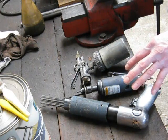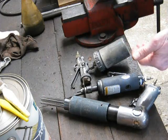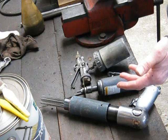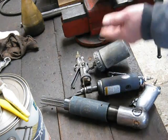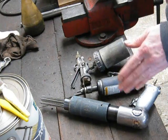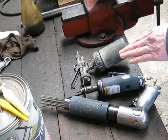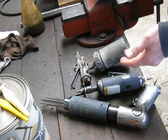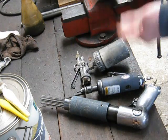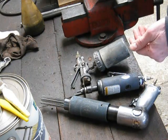The problem also is that a lot of these air compressors you buy have got the dryer bolted on the tank if you get a dryer with it, and that's no good either because the dryer is too close to the tank. The compressed air coming out is warm — it's higher than the dew point at which water vapour will condense out — so the dryer doesn't do much because the air's too warm. Before it can actually do anything, you have to get that air temperature coming out of the tank down considerably so the dryer can then work properly.